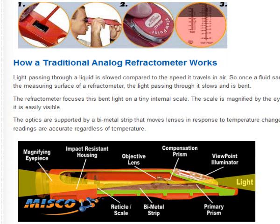Here are the simple steps we need to follow. The very first thing to realize is that inside our refractometer is the prism and some other lenses, so you want to be very gentle with the piece of equipment. This is especially important here because if we were to bend or cause that lens to deflect in any way, it will skew the results. The first step is to lift open the viewfinder and the illuminator.